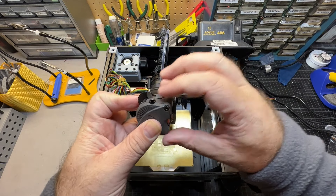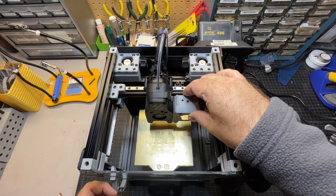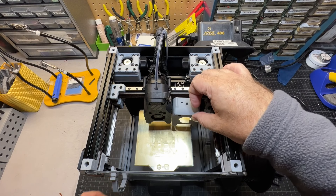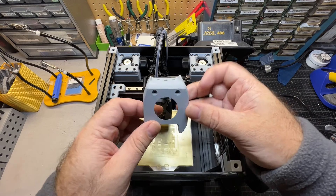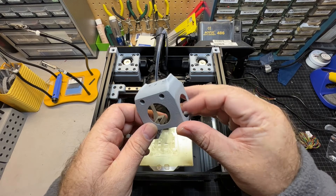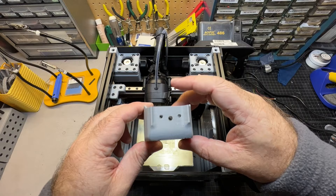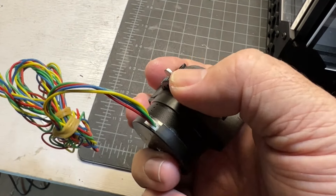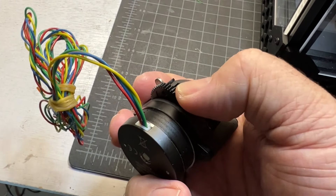It's just a little bit easier and more repeatable because there's only three positions, whereas with the mini afterburner you're turning the screw back and forth. Side by side, there are a lot of similarities — the profile is pretty much identical and the part is very similar to what you'd find on the mini afterburner. It's pretty much like-for-like in terms of fans: you put a 3007 fan for the hot end cooler, and 3010 fans for part cooling. The ducts are also very similar. An advantage of this large gear extruder is that there's more grip on the filament, which is especially handy when printing things like TPU.